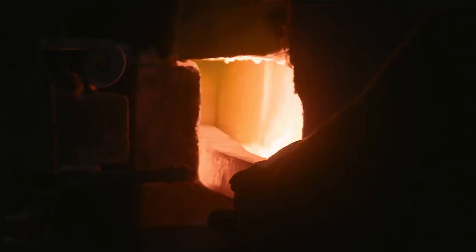Once the bars are completely made to the size we need, they're going to have to take the center sections and drive them to an octagon. The reason is, if we leave the standing corners of the square and then go to the screw machine, as it twists, those corners can overlap and leave bad welds.